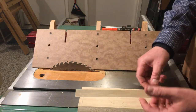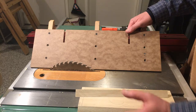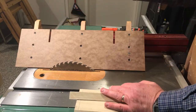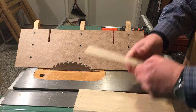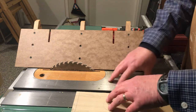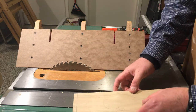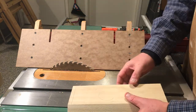That concludes the demo of our 45-degree bevel sled. To get everything right — pull all the distortion out of your workpiece, clamp it to this jig, and run it through the blade with a nice constant motion. The bevel is in the details, folks. We're out of here for this episode. I hope you join us for the next episode — that's going to be part four of our workshop jig series, our Jigapalooza on table saw jigs. It's going to be a really cool jig. Until next time, keep on making some sawdust.